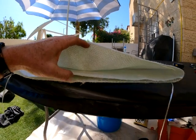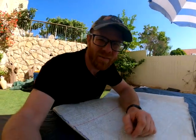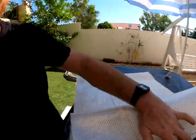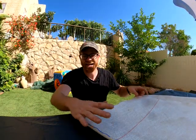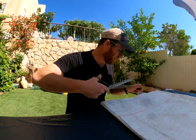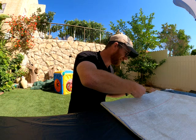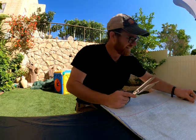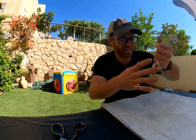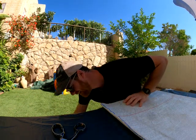You can see we've got one layer there, two layers, three layers. And guys, matte side is out — matte side is the one that's going to be where the flow of the water. The shiny side does not touch the water. People think the shiny smooth side should face the flowing sewage — no, don't do what you think. Ask the suppliers what it's supposed to be. The matte side is the one that's going to be exposed to the gases and the chemicals. Make sure you're doing the right stuff.